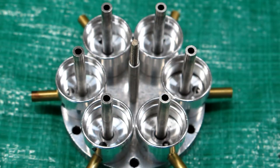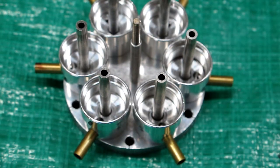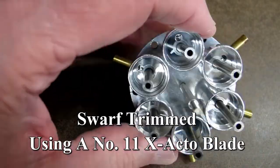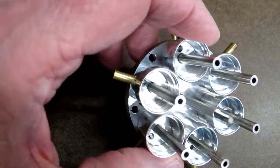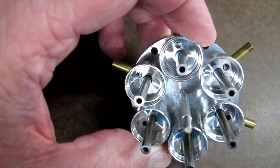So I'm going to wash this all out with mineral spirits, blow it out with compressed air, and try to put it back together clean and see if it'll go again. Washed with mineral spirits, blew it out with compressed air. Rinsed it with denatured alcohol, blew it out with compressed air again. That's what it should look like — clean and shiny.